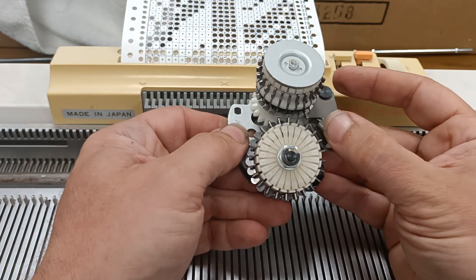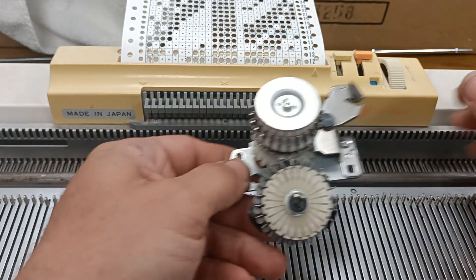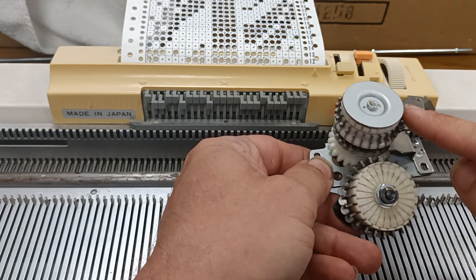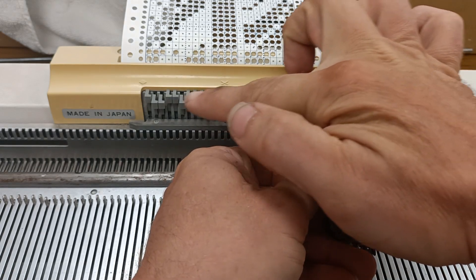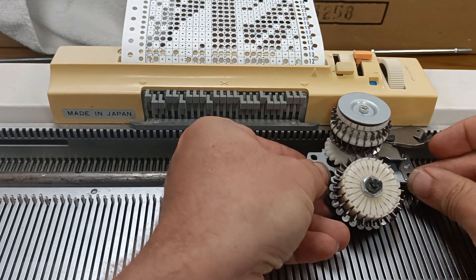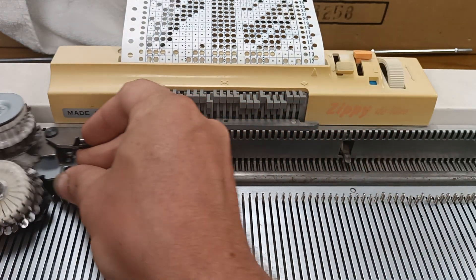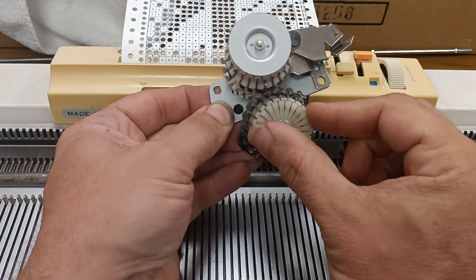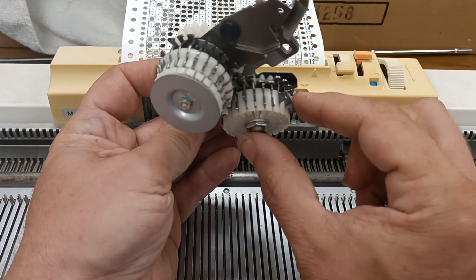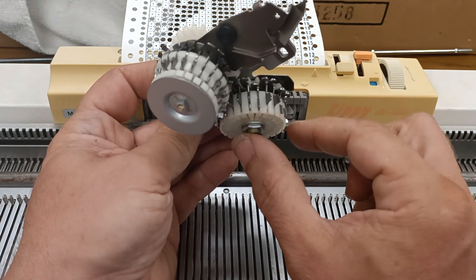So this is what Lovelace invented — she invented a means of storing a number on these drums. Here's a number, and what it's going to do is use this top drum to pick up the number from here and store it on this bottom drum. The top drum is basically just a transfer. So if I run this across, you should see that it's picked up that number. You can see I've now got some that are down and some that are up, and that pattern will be the three 8-bit numbers that we programmed into it.